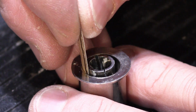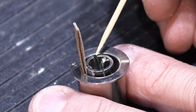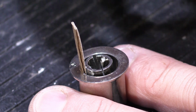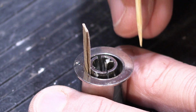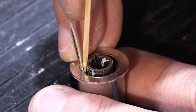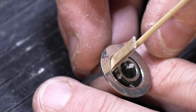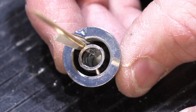a piece of cardboard here in the center. Now, the crack is across here, so we want to be at a 90-degree angle. We want to be here, so we push against the crack evenly. You don't want to do it right next to the crack over here, because that's not where you need to push. You need to push it this way. So you put the piece of cardboard in, and then you get the toothpick and you shove the toothpick down on top of the cardboard, and it won't go in as far, but it goes in far enough, and that closes up the crack nicely.